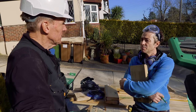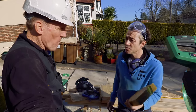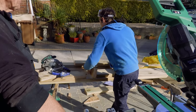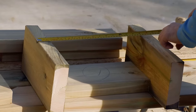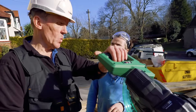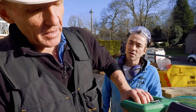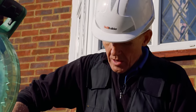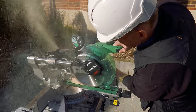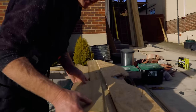I need you to make some bridging or noggings — they need to be 353mm, every single one. So when you put that in between two joists, you've got 400 centres bang on. You can set up a template — clamp a bit of timber there. I'd say make 12 to start, because there are a few we need to make a different size as well.